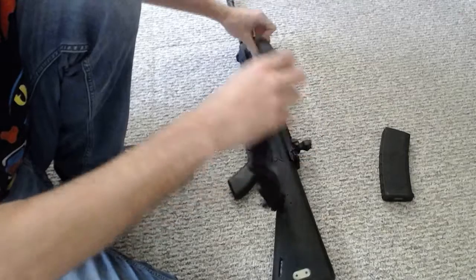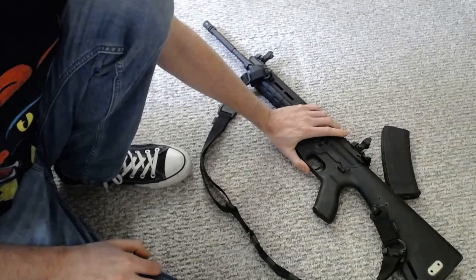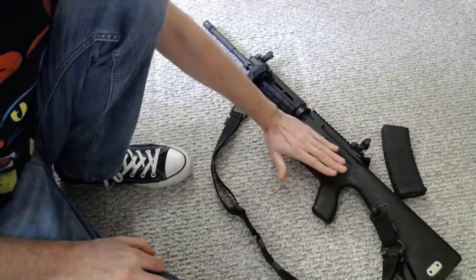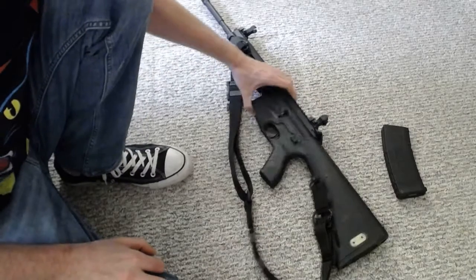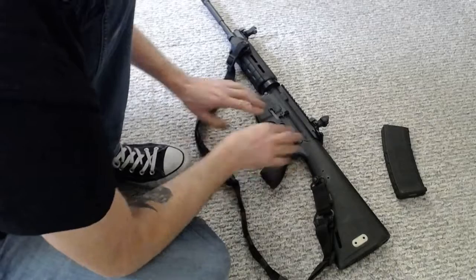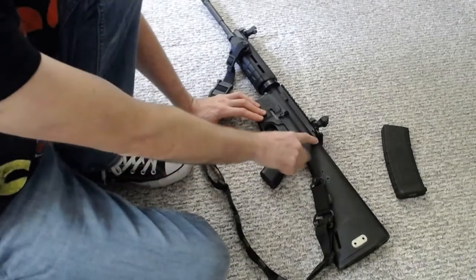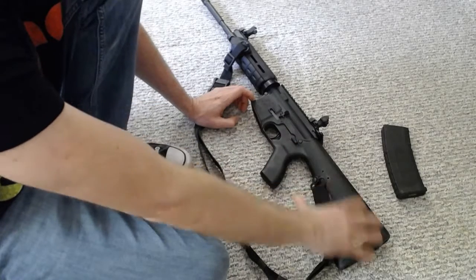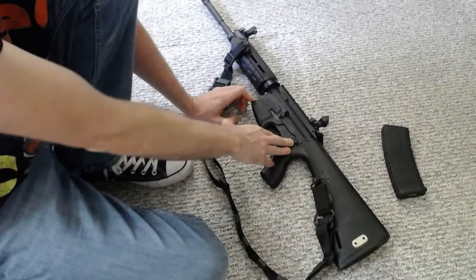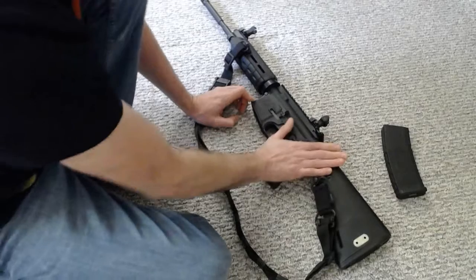Overall I'm very pleased with this build. It's one of the simpler, cheaper builds I've done, but being polymer it's cheap enough that I can throw it around and trash it — it's not gonna break. I've seen tests where people drive over these polymer lowers and they keep on going. What separates this polymer lower from others is that traditional polymer lowers copy the aluminum lower receiver design exactly, which creates a weak spot. Since this is its own design, it's very thick and sturdy in a one-piece construction. I've even run a 50 Beowulf with this lower and it handled it just fine.